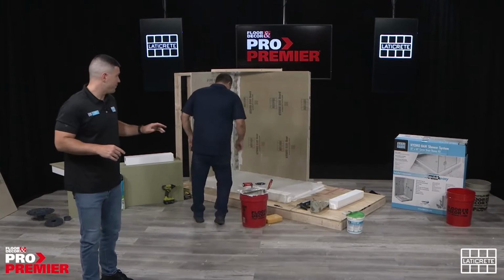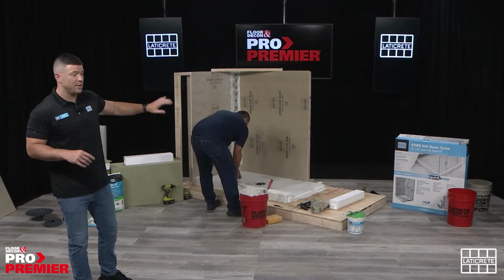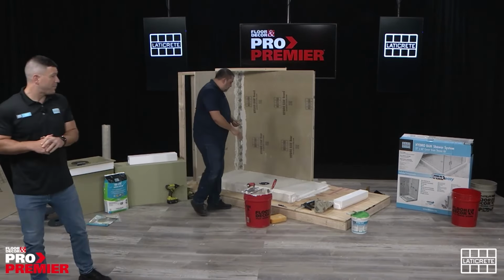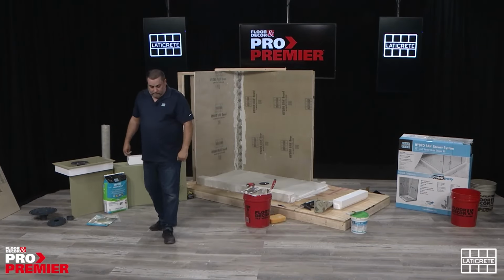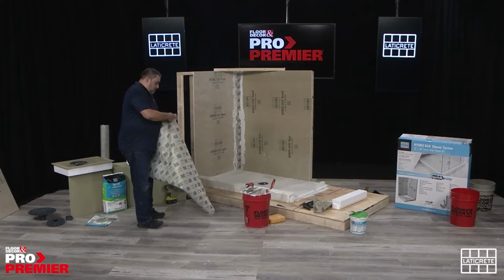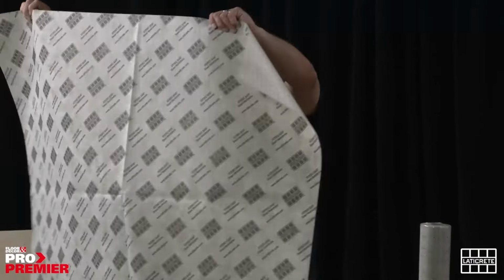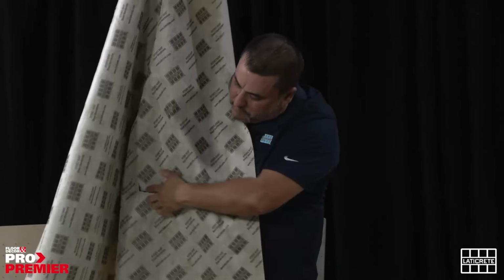All right, now that we have thin set coverage across the pan and the curb adhered to the pan, we're going to drop that final piece of sheet membrane down on top of the pan and the curb. Again, as I referenced earlier, the pre-cut pieces for the floor portion are oversized to account for overlap on top of and over the curb.